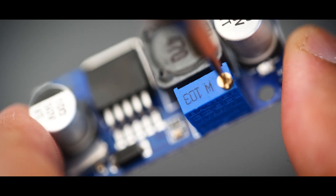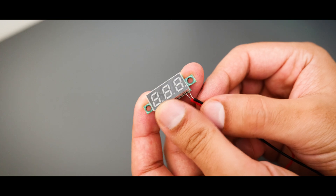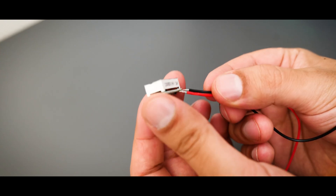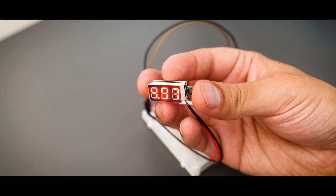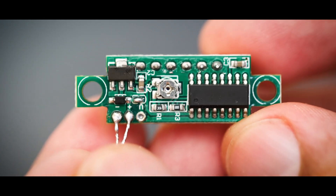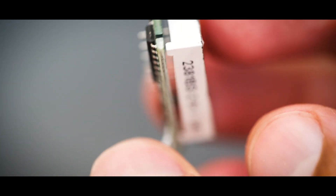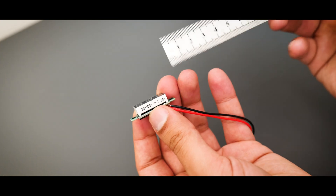The second key component is this voltmeter. Before this project I didn't even know this thing existed — I went on Amazon to find something loosely related to what the project needed, and it fit the bill perfectly. It's simple and easy to use: it's got a ground and power lead that connects to a component or breadboard and displays the output voltage on a display. The beauty of it is that it's got an integrated circuit already in it, so you don't need an additional microcontroller to do the voltage reading.